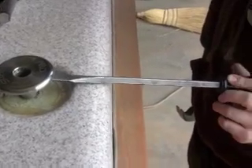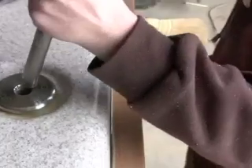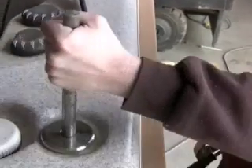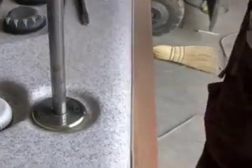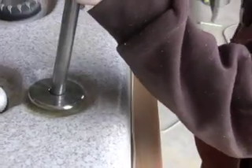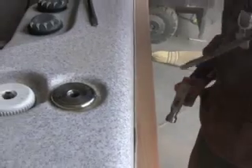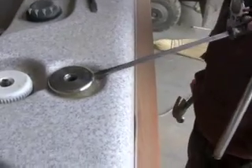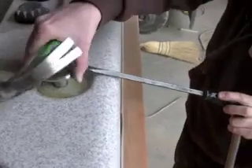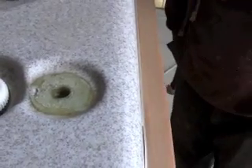The bottom falls out, so you've got to wiggle it back and forth. Here's your optimal situation — otherwise it's going to take a little bit more excessive force. Use that bar, pry back and forth, and beat out that bottom shaft, then pry off the top piece. Once we pull that out, we're going to have to clean up the plastic weld around the edge, sand it down, and then drill in the new receptacle.